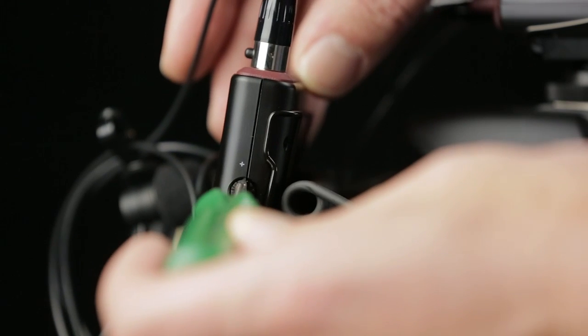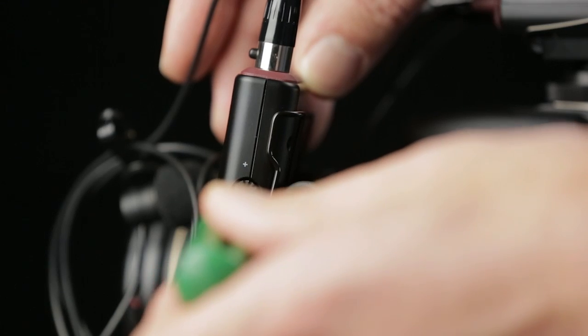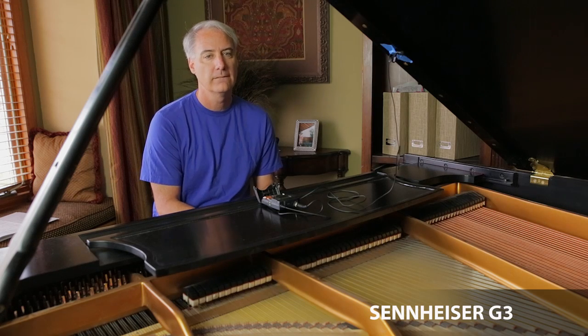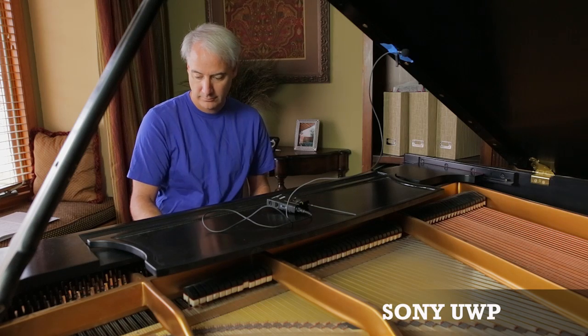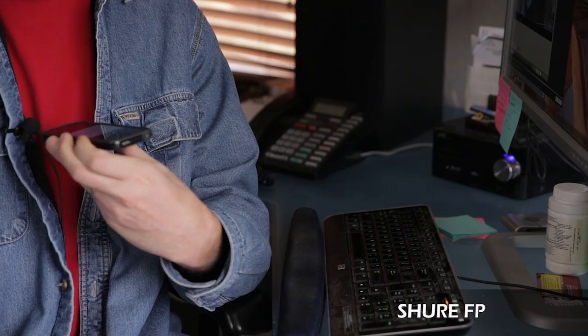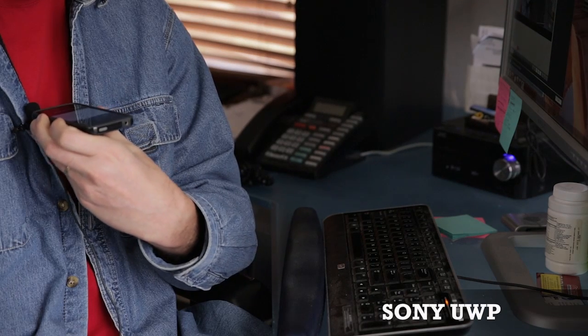One of the first things I wanted to do was get the gain structure of all four microphones somewhat equal. I used pink noise on my iPhone at pretty much the same distance from the mic as from my mouth. I ran them through a bunch of different tests and noticed something really odd on the Sony that the others weren't doing. I thought it might be a transient peak issue, so I played the piano — which has very high transient quick peaks — but that wasn't it. Then I tried a sine wave pure tone 1kHz test, but I wasn't really seeing anything there either.